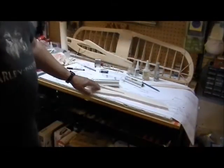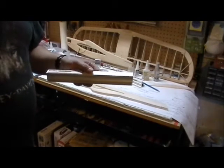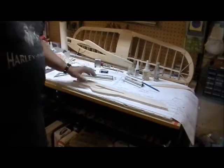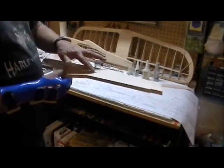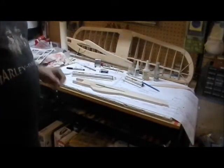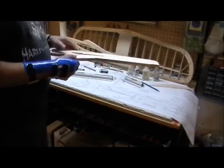What I'm doing with the fuselage is giving it that final sanding — I'm using 150, fresh 150 in the old easy-touch thing from Great Plains. These things are nice, got that nice shape to them. Once you glue your wing in, getting everything sanded nice and smooth is gonna be really hard — you might end up dinging the wing. So while you can still lay it down nice and flat, I'll give it that final sanding now.